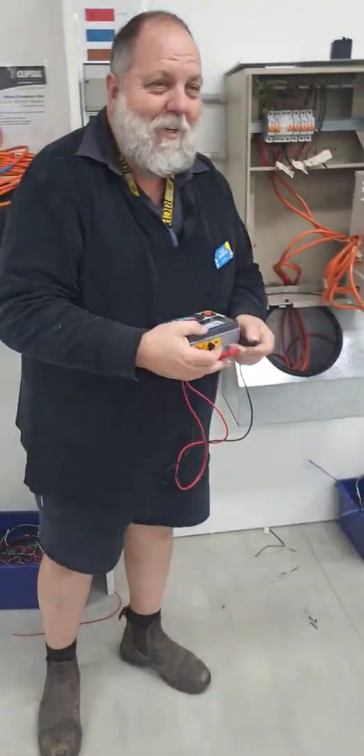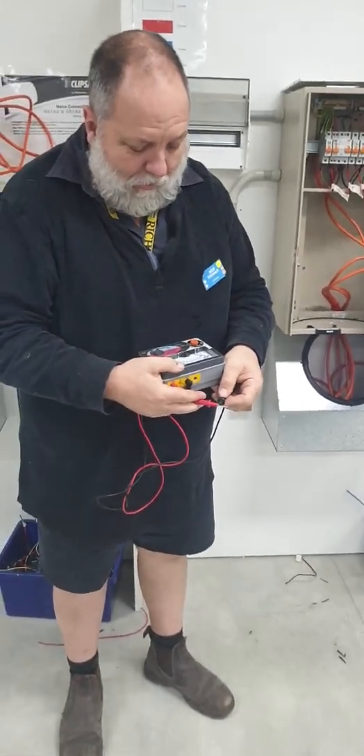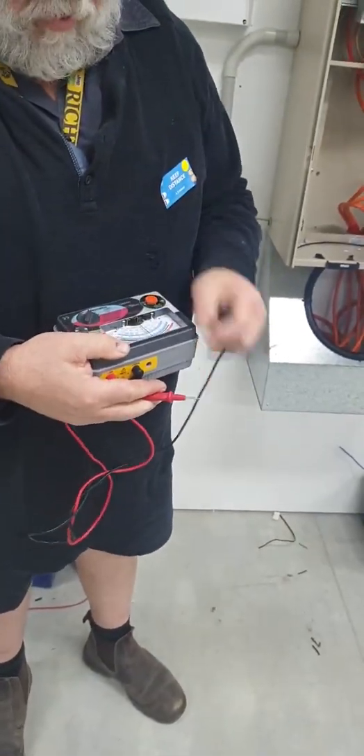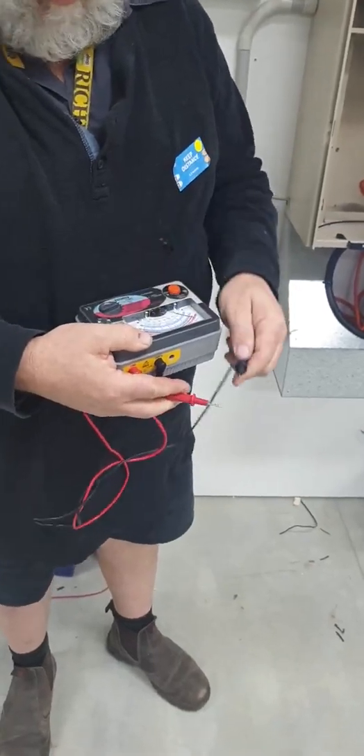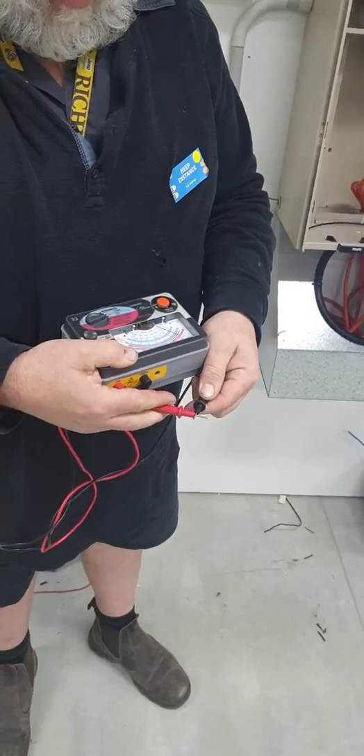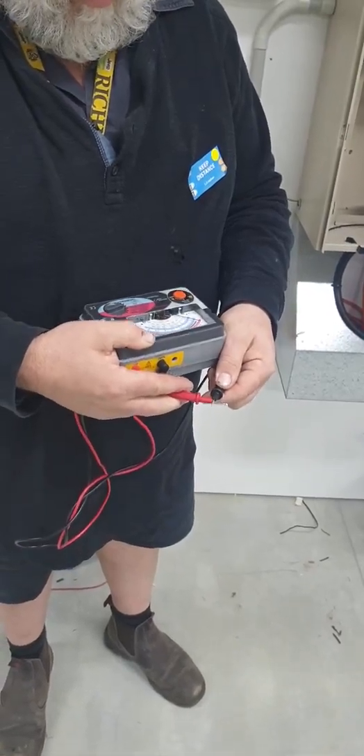Take two. What I'm going to do is check the meter, make sure it works on battery — we've got a good check and a good reading. Next thing we're going to do is zero in the meter on ohms, so as I push down the meter we have a look — we have zero. So zero it in, no problems.